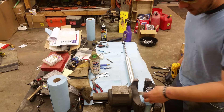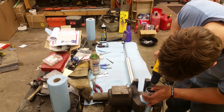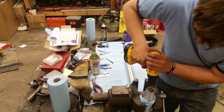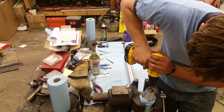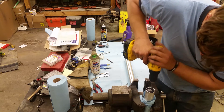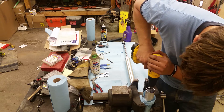First, to get the gas pressure out of here — we've got about 200 pounds of nitrogen — take a really small bit and find the center, which you'll be able to see because of the machining of the cap; it's about a half-inch thick total. I've been pulling the bit out every now and again, cleaning it off, because the last thing I want is that aluminum to build up and snap the bit off in there.